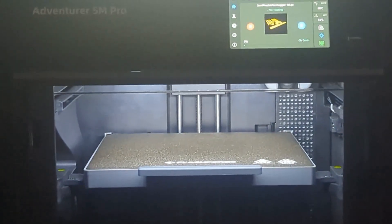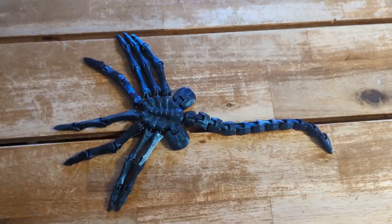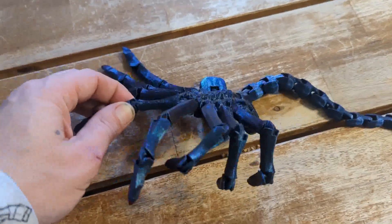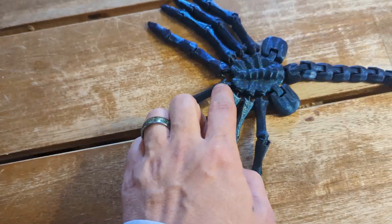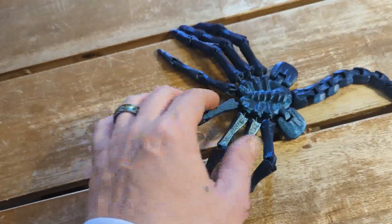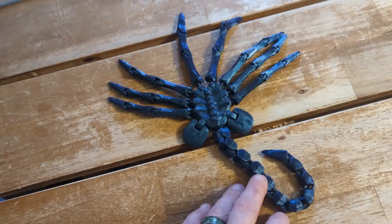The software is also included on the USB stick, and this model came out really, really sweet. I'm going to show you here as the machine gets ready and starts up, and then show you what the model looked like when it was completely done. It's important to note — I did have a power failure while printing this piece. As you can see, it is pretty awesome. You can't really tell that I had a power failure. The resume function worked really, really well. This wasn't a print-in-place; it was printed in several pieces, but the pieces snap together and the tolerance is about perfect. This is actually the bottom side and it's almost indistinguishable from the top side, even though you can get a little bit of the PEI texture at just the right angle. This model spit out in about an hour and 20 minutes — that's for every piece. The whole build plate was full, and everything went together just perfectly and amazingly well.